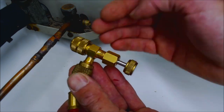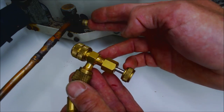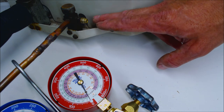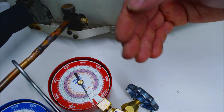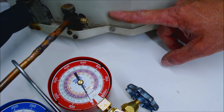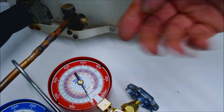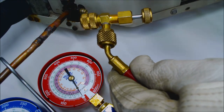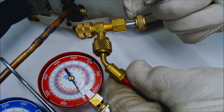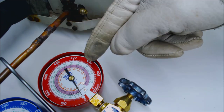This is a very controlled way of disconnecting from the service valve. We're currently using 350 psig of dry nitrogen in the system — just so the system isn't making a lot of noise while we're connecting and disconnecting. We have the valve core depressor tool with the back seat and the thumb screw attached to the refrigerant hose, which is attached to the gauge.